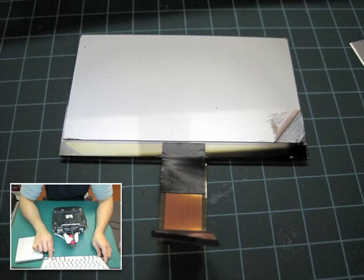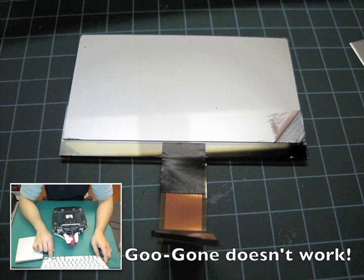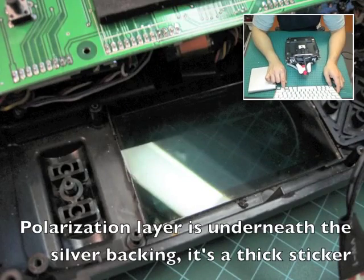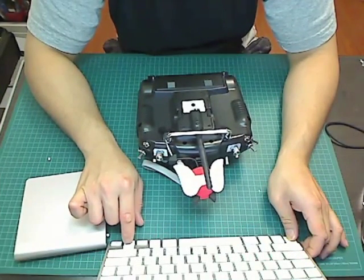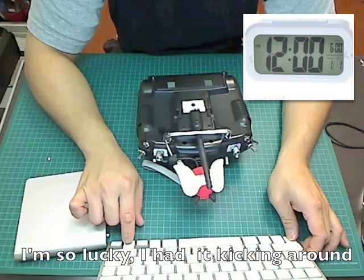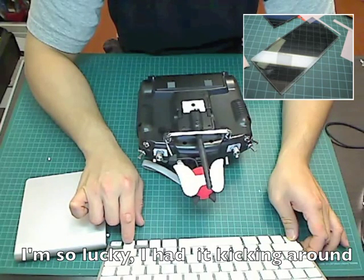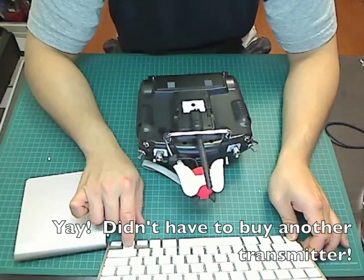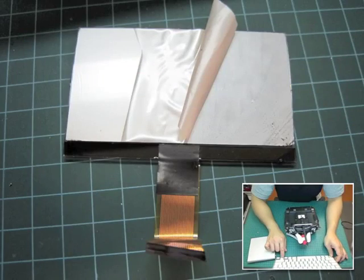There's a silver label on the back of the LCD screen. You can peel it off but it's hard to remove the residue, and I wouldn't recommend it. I accidentally removed the polarization layer with the backing, which meant I couldn't see anything on the screen. I fixed it by taking the polarization layer off an old LCD alarm clock and sticking it on the back of the 9x LCD screen — and it worked.